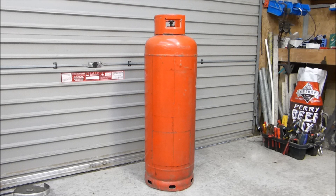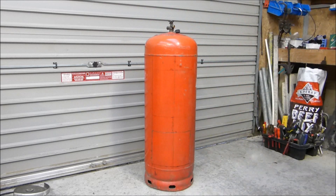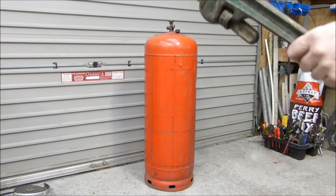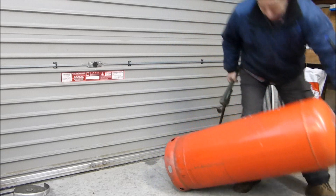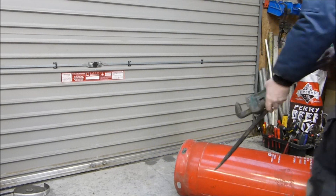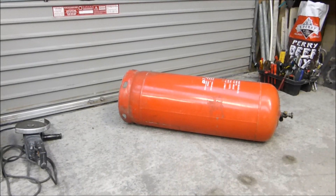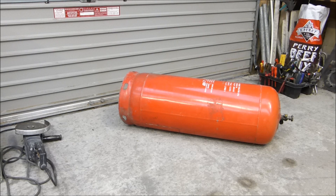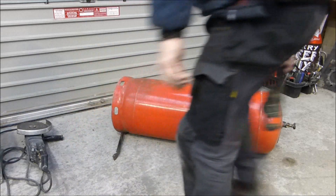In order to do that, what I have already partially done, is I am going to cut the neck off the propane tank just with a small angle grinder — just cut this off. The reason I did that is so I can get to the valve, so I can take the valve out of there with some sort of a bar and a pipe wrench. In order to get the valve out, this particular tank has holes on the side of it and the bar stops it rotating.